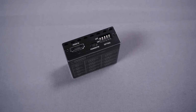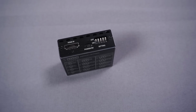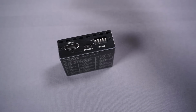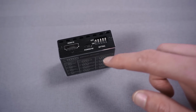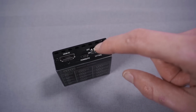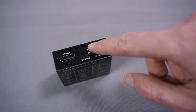And that device name is the GD32 USB DFU in FS mode. That's what this shows up as. And then Googling GD32, that brings up the Giga Device GD32 microcontroller, which seems to be a sort of pin-compatible alternative clone that's apparently faster than the very popular STM32 microcontroller. So we'll pop this open now and see what's inside it, but I suspect we'll find some sort of Giga Device GD32 microcontroller in here.